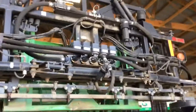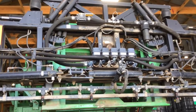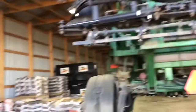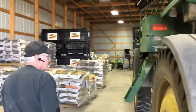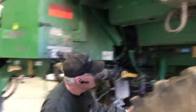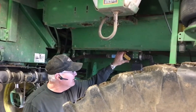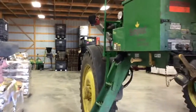Make sure they're free of residue. There's the main filter up there and there are five of these small filters. Put them back on, then make sure you close all your valves after you've done all this, and make sure you've returned these valves to the right position — solution, spray — and remember to open this. You can run that about there and you'll get adequate agitation and not as much foam. And that's basically the rinse system.